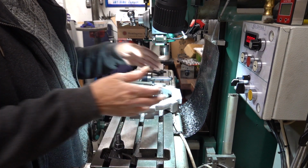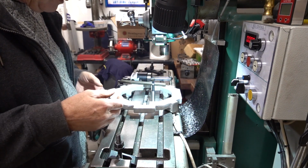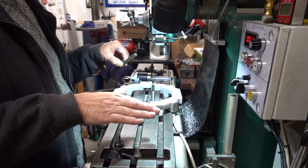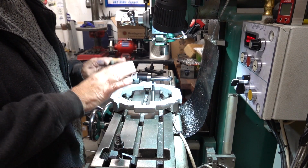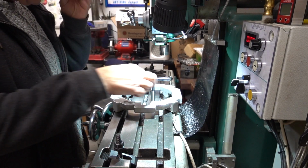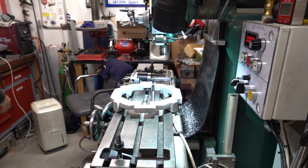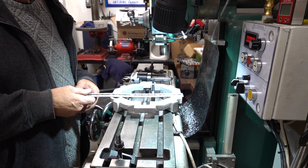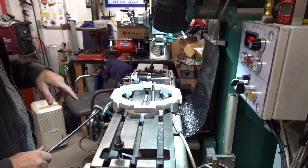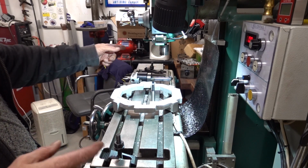Right, so I've machined the rod pads, if you like, down, and it now lays flat on here, which is what I wanted, so I can get a skim off, so the reference will be the same from the back to the front. And as I was talking about earlier, I'll have to use a fly cutter because I haven't got that much Y movement. So that's 8.5 inches. I don't have 8.5 inches on my Y. I've got tons on X. It's a huge table on X.